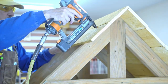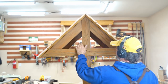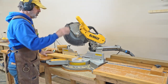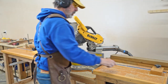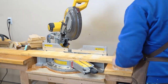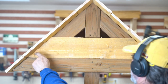I'm going to fill this area with some more pickets — I think it'll look a lot better. Maybe I'll put some trim up there. I'll measure this, cut a 45 on each side, and see if it fits. I'm going to cut two of these; the measurement is 30 and a half inches. I'll cut the 45 first and then get precise with it. I'll set my stop block to 30 and a half, go to my other 45-degree stop. Fits nicely. Now I know the other long measurements, so I'll cut my next board with that measurement.